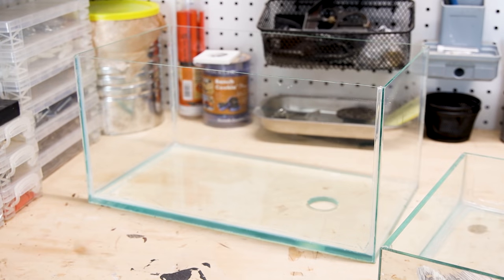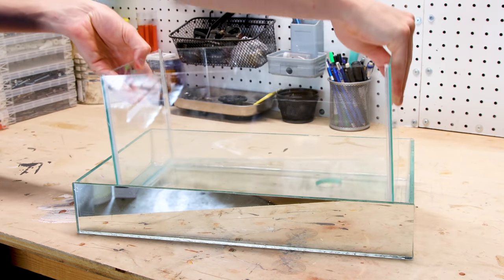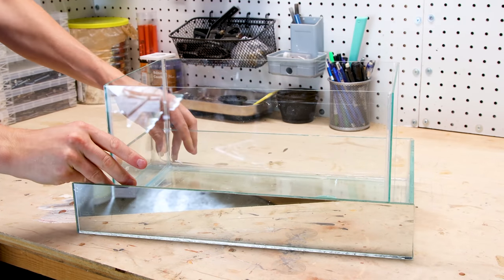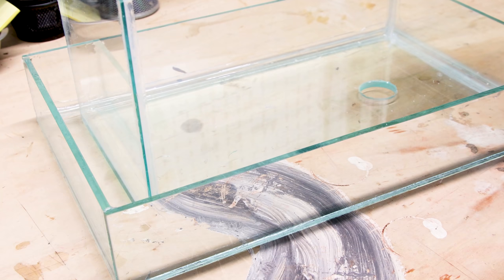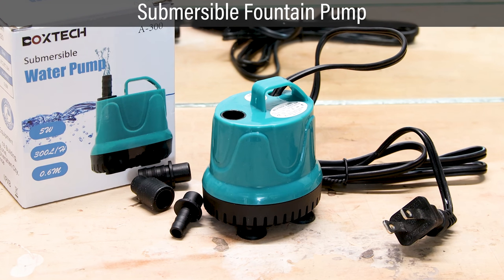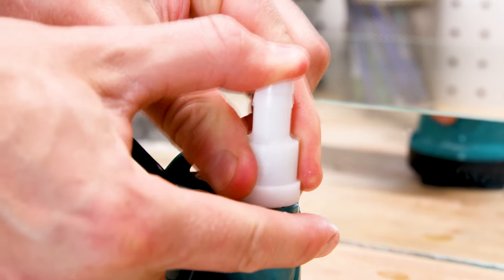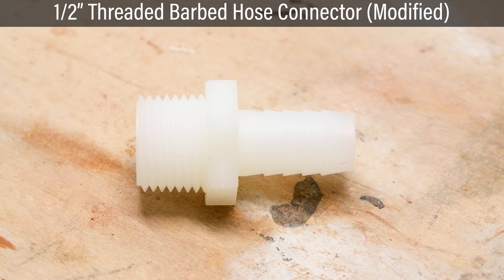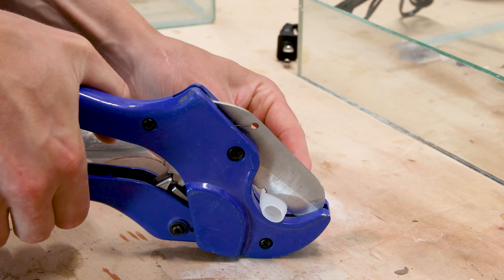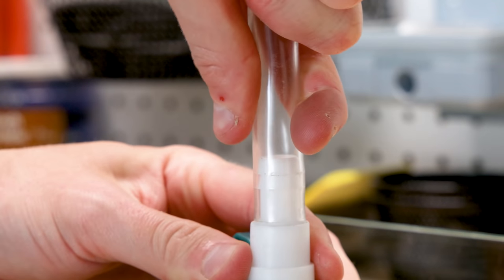What I ended up with are these tanks. The small one, which holds roughly 5 gallons, was made to fit inside the other tank. It will be lifted up and used as the overflow. To get that effect, we need a few other components. To get the water flowing, I'll use a small fountain pump. My idea will only work properly with a check valve — I modified one so that it fits into the pump. I also used a barbed fitting to tie into the bulkhead, and modified this piece as well. I connected it all together with a vinyl tube.